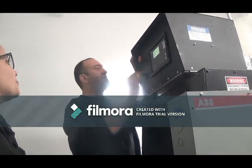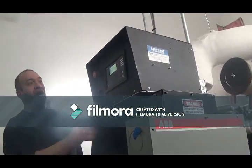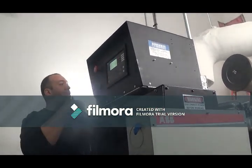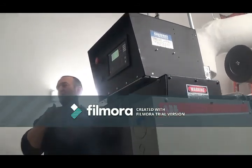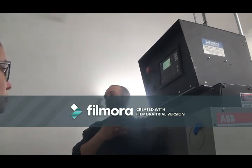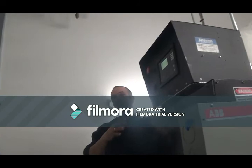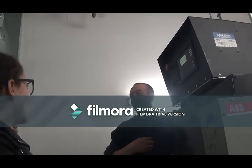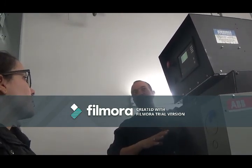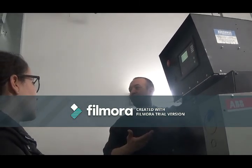The coolant, that's your temperature of the coolant. When the generator runs, it's going to be higher. When you have it running, give or take, you don't want it to pass 205. It's a natural gas unit, so you can go up to 205 to 210 safely. Diesel engines don't like it. You want to keep it below 200 degrees Fahrenheit. It has a sensor again. It'll shut off by itself if it overheats. I'm just telling you what you want to keep an eye out for.